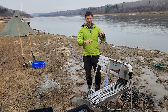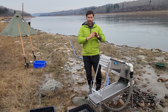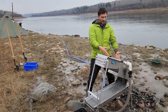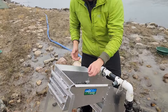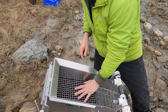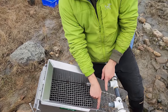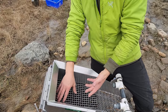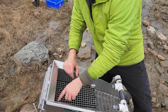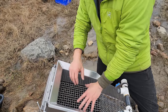Every single part of this — we just spent so much time trying to find the most durable and elegant solution to pull your mats out. Step one is the hopper. This is a stainless steel screen. This stuff is incredibly hard and durable. I actually used this thin screen as my hopper wear guard once for about three years — the same screen — and it just will not break. This was the last part of the entire highbanker that was not stainless or aluminum, so this is now stainless.